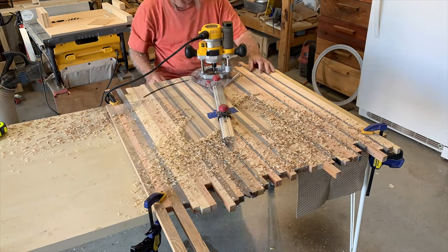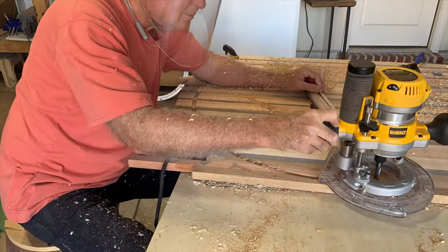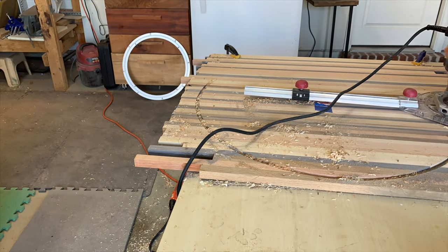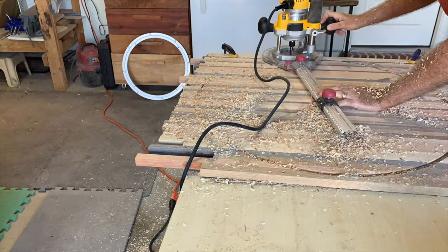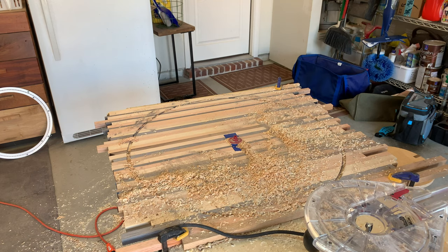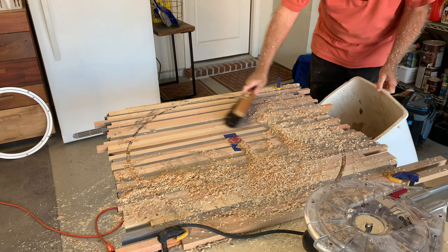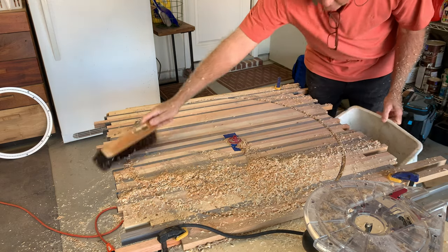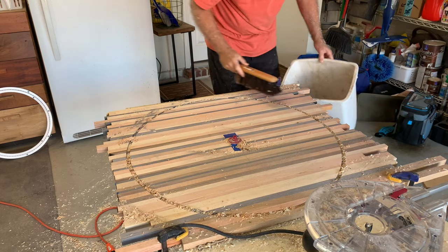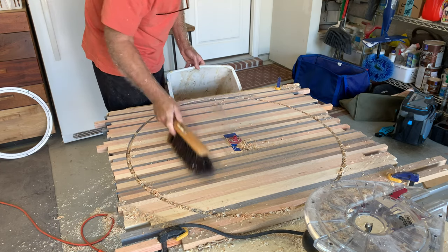This thing makes lots of chips, but it's a lot of fun. I'm only cutting about a quarter inch each time, and I bought a special spiral up-cut bit for this process — I'll leave a link below so you can see this bit. It cut fabulous on three different cuts. We have the first cut — three-eighths and a half inch — and it was a nice cut. We even got back to our original spot, and you know what? It's round. That's really helpful.